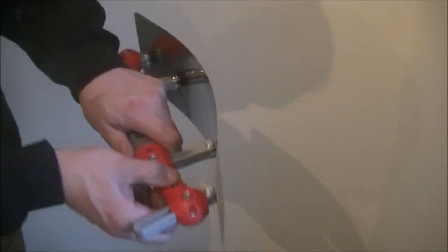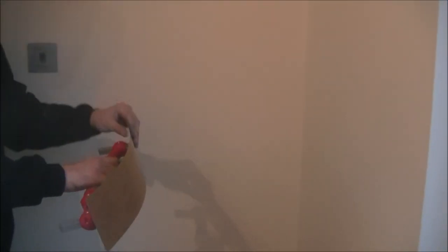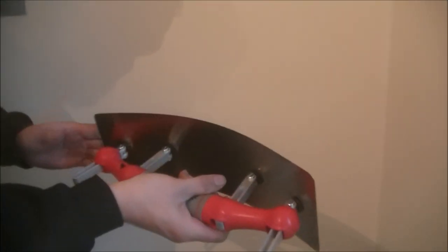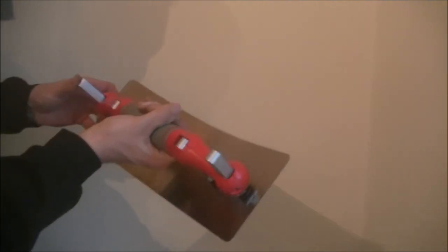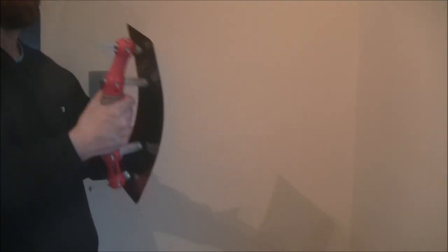Obviously it has a wee spot for that - one side longer than the other. Fits in perfect, it's quite tight so you shouldn't lose it. We've got an arch going on here. I can drop these out as well and get a wee bit of extra bend. So if you're wanting that wall to curve, obviously you will stud it a bit too. That'll be pretty good for the likes of lofts as well - it's going to give you that bow, and it also can bow the other way if you were doing say a column.